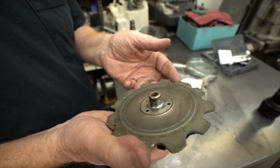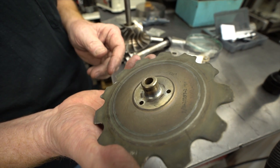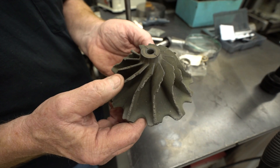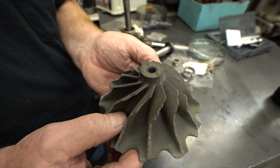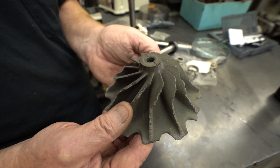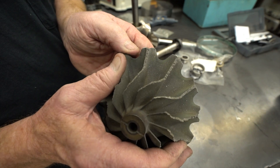You can see the cracks on the back — this wheel was ready to disintegrate and come through the side of the engine. So you want to be really careful when you run these things hard. If you over-temp them, they'll take a little bit — they're a fairly resilient engine. The first thing that will go is the seal plate will warp the heat shield on it, and that will be the first indication. Most of the time these will grind to a halt. This one was pretty badly abused, and I keep it here to show people just how bad it was.